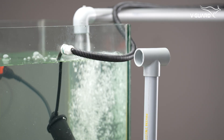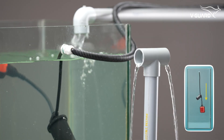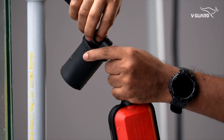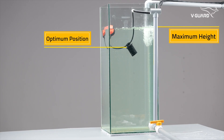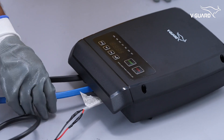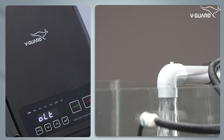During the trial run, check if the tank overflows — if it does, lower the dead weight. If the tank is not filling adequately, raise the dead weight. Inspect all cables and connections for damaged or frayed ends before powering on. Turn on the pump.